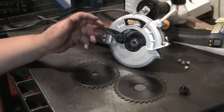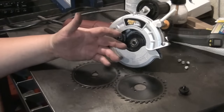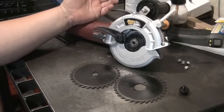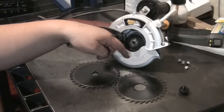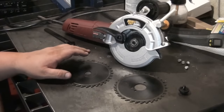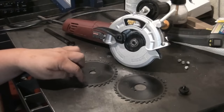it doesn't really do an awesome job of lubricating unless the blades are hot enough, meaning that you have to do some kind of cut first, and especially on aluminum, once the machine gets to operating temperature, I guess, because it pretty much gets up to a high temperature, and that's when that wax actually melts at a certain temperature to lubricate these blades here. So if you do a lot of steel or anything, or you try to do anything thick, you're going to get a lot of material wanting to bind in here.